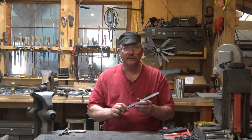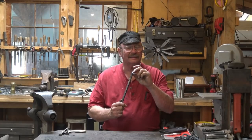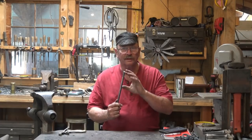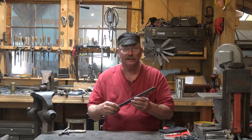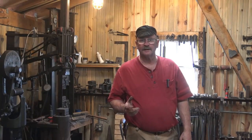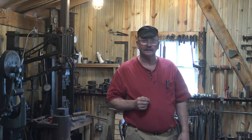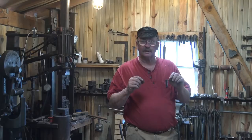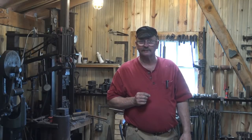We're going to use a piece of quarter by three quarter, about 12 inches long. We're just going to worry about the end detail that makes it a snub end scroll, and scroll up the end just enough to give you the idea of what that looks like. The key element for any snub end scroll is the snub — the thick section at the very end. It should still taper gracefully from that point until it reaches the same thickness as the main bar, but you need to define that snub first.